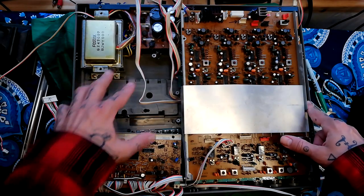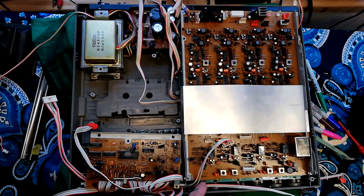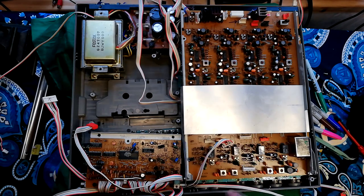I've had this plugged in without the transport in it, just to test the mixer. A lot of stuff in there is sounding really rough. It sounds like we've got some either dirty or maybe even some soldering problems with the input jacks, and crackly pots and everything.